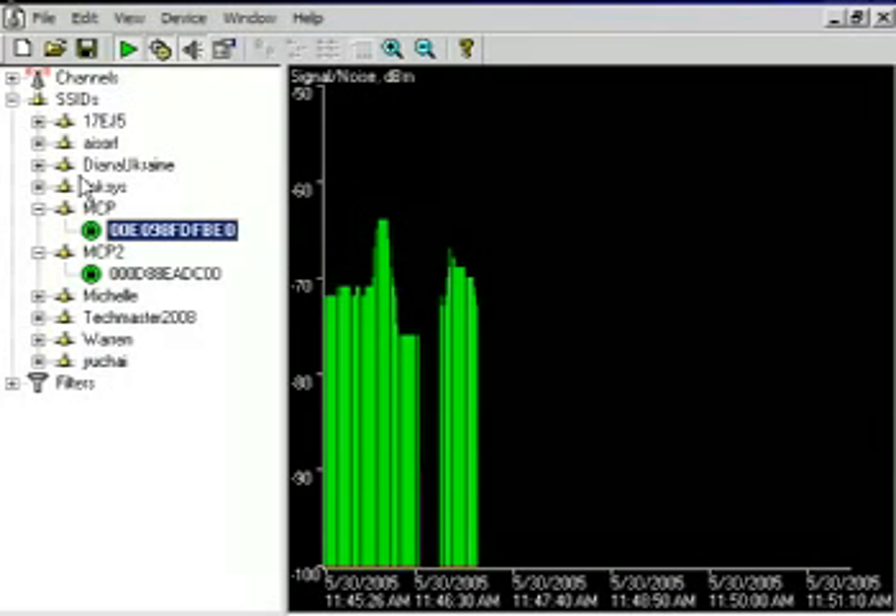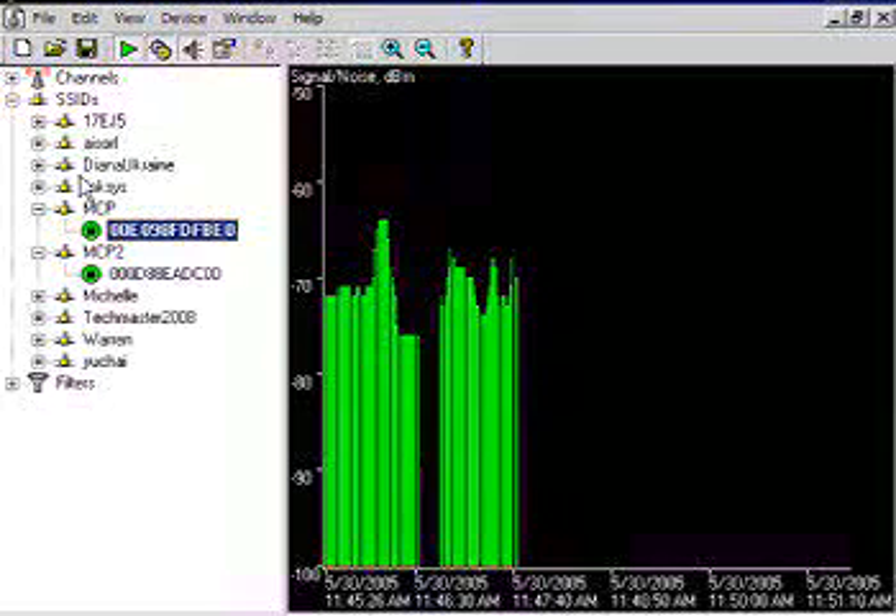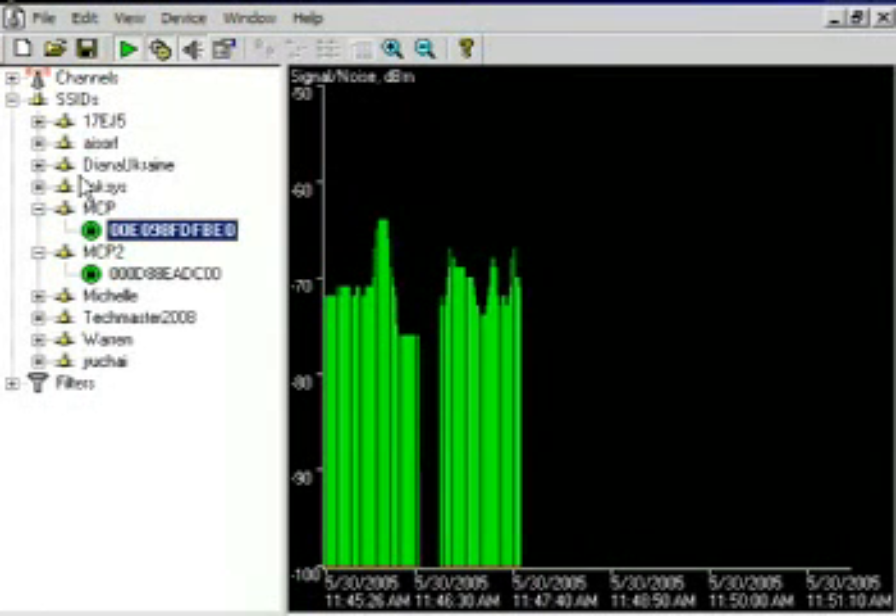The antenna is working. A note about the coils themselves: try to get the gap between the coils as close together as possible — make sure they're not too far apart, as that will actually affect the gain as well. It seems to be working — it's giving us about six decibel gain, five decibel gain above a stock rubber duck. So there you go: compact collinear antennas, definitely worth war driving with.